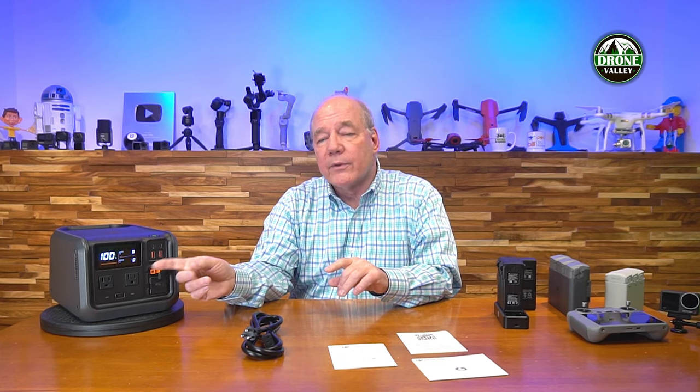Both sets of ports are quick-charging. The USB-A ports support the QC (Quick Charge) standard, which means when you plug in a compatible device, the port recognizes it, interrogates the device, and adjusts voltage and current throughout the entire charging cycle to quickly and safely charge it. The USB-C ports support the PD (Power Delivery) standard, which does exactly the same thing — if a drone battery is at 50%, it fires higher voltage and current; as it approaches full, it backs off. All four of those ports are quick-charge ports.